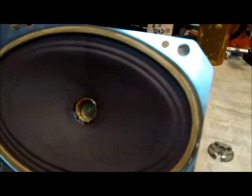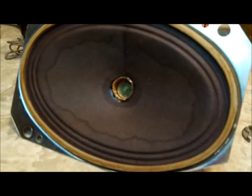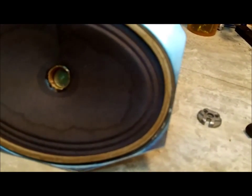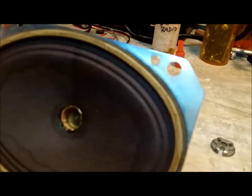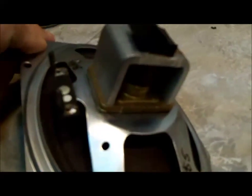I think what I'm going to do is — I found a replacement on eBay for seven or eight dollars shipped. I think Boss is the brand name. It's probably a cheap speaker, but it's actually probably better than what's in here. It's got the round magnet and it looks a little heavier. I'm going to try to find some measurements of this, because this piece here presses up against the back of that speaker and that's what that rubber piece is for. I think I can fit some rubber in there if I need to. I'm hoping the filter capacitor will be able to clear it. I don't think the magnet is any bigger than that space, so we'll see when I get it.